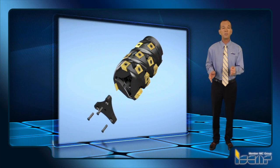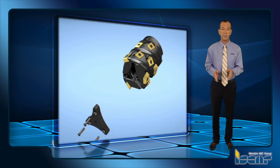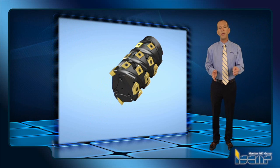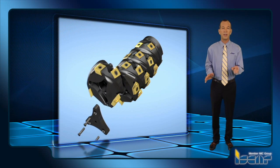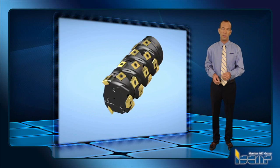As a rule, the most loaded inserts of the extended flute cutters are those that work both by main peripheral and secondary face cutting edges — for example, the inserts mounted on the cutter face. The breakage of such an insert may cause failure of the whole cutter. In this case, the use of replaceable caps, face milling sections of the modular tools, can solve the problem.